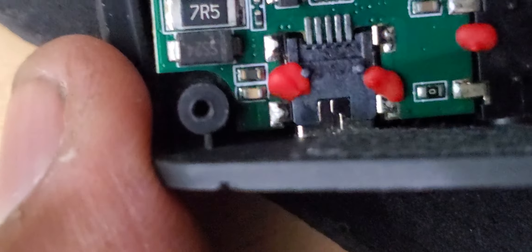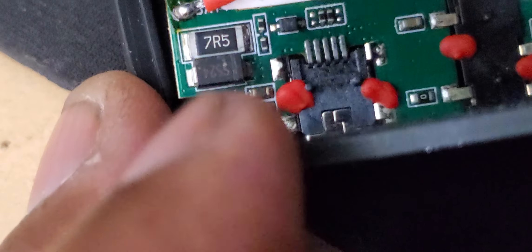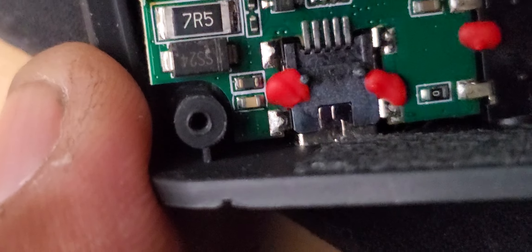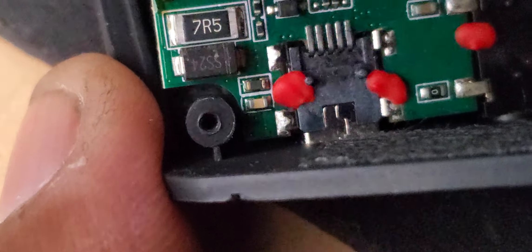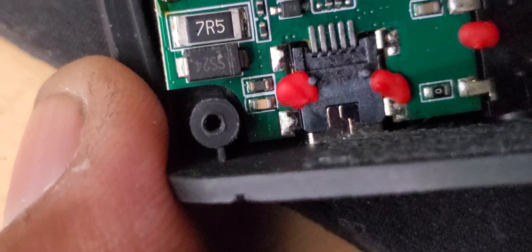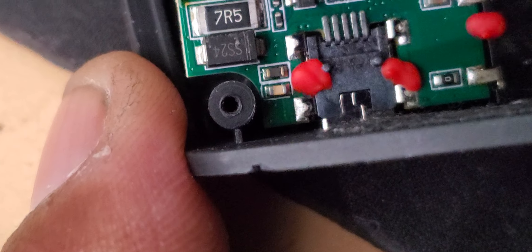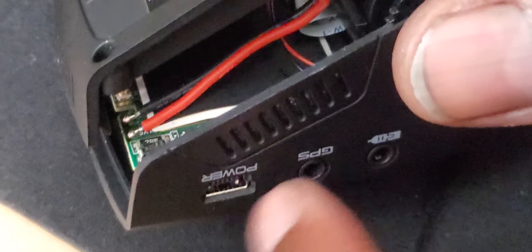Of course that means you can't unplug it anymore, but that's one way to do it. Another thing you can do is switch out that unit itself by desoldering the four points — one, two, and then there's two on the other side. You unsolder those four points and desolder that connector to replace it. Honestly, I would rather put leads on it, and if I wanted to keep it as a connector I would use a USB-C as the connecting lead — wire the negative and positive, come out through the little hole, and the end would be a USB-C connector. That's a serious upgrade. Then I would use hot glue to plug up the hole and keep the cable from moving.